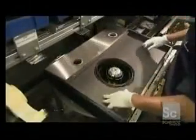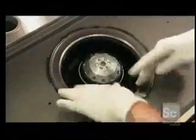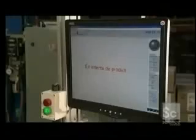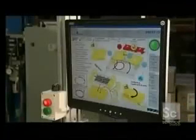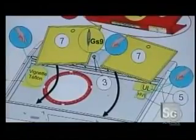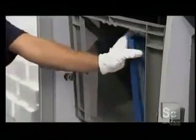After snapping a panel on to enclose the hood assembly, a worker attaches a plastic ring to direct air through the blower. A computer system tracks each model's assembly. When workers complete a step, they input it into the system. An optical scanner also senses when they remove a part from one of 25 cubbies, like these removable air filters made of mesh aluminum.